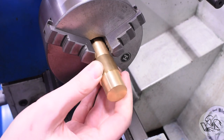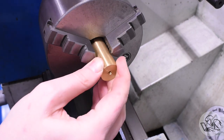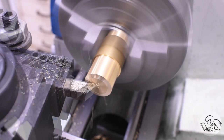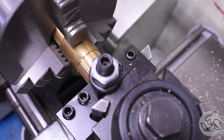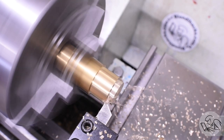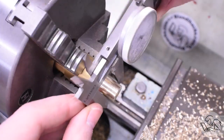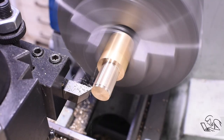I could buy an adapter but I'm pretty sure I can make it in less time than it would take to find one in the plumbing aisle. I've got a piece of scrap here — I'll start by facing it off as is tradition. I'll square up the tool post and turn down the OD for the fitting I need. The fitting that came on the end of the pump is M14 by 1.5 metric thread, and my boiler has 1/8 NPT on the steam dome, so that's the adapter I'm making. Brass is so fun on a small lathe that I got a little carried away and overshot the dimension by a lot — standard imperial fist shake — so I made the part again to the proper dimension.